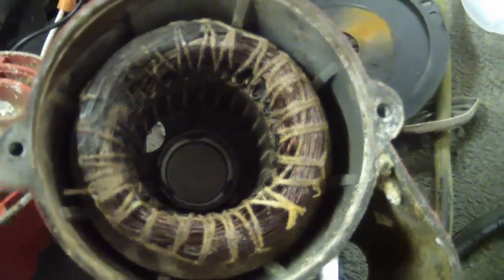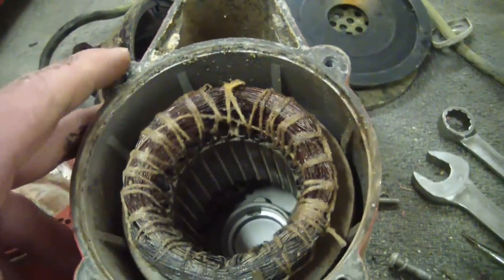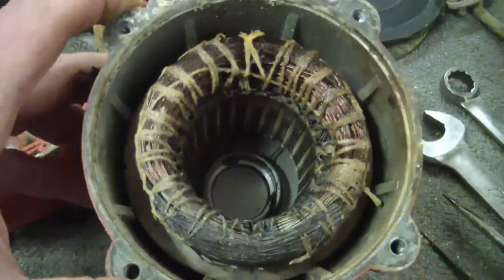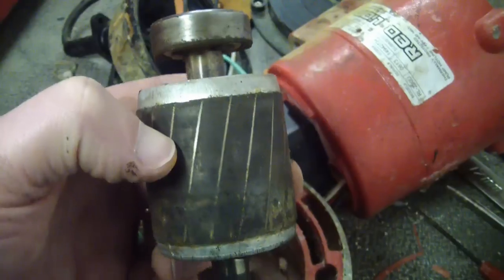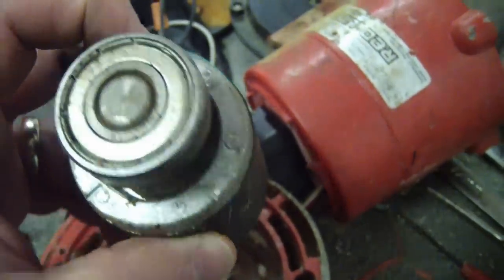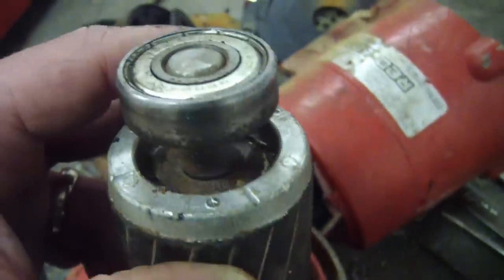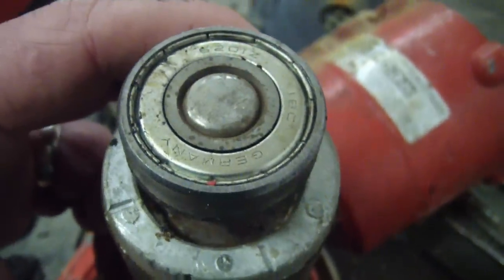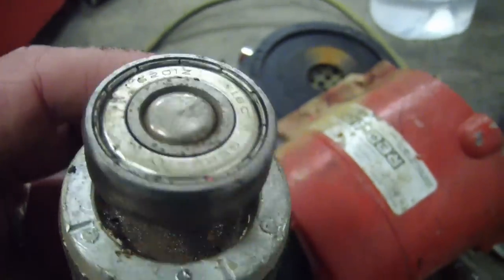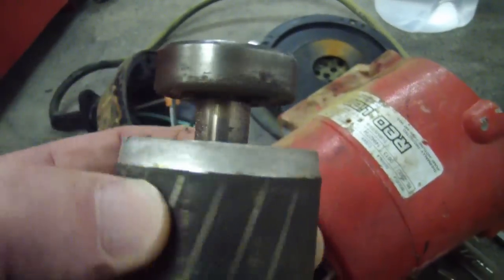The housing itself — you don't see very much white death in there. Again, instead of an O-ring they have a proper seal engineered and manufactured specifically for this. Spare no expense — this is a good pump. There's the motor rotor with a nice big beefy bearing. IBC, made in Germany, 6201Z. There's only one Z because they're saving money on their shields. Of course that's a shielded bearing, not a sealed bearing. In a pump, you would like to see a sealed bearing — there's going to be some water ingress.